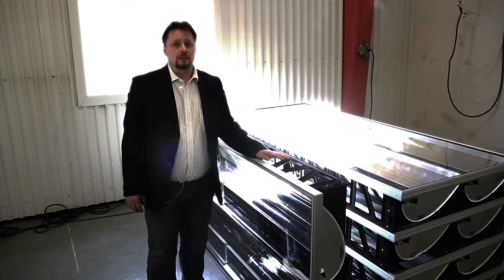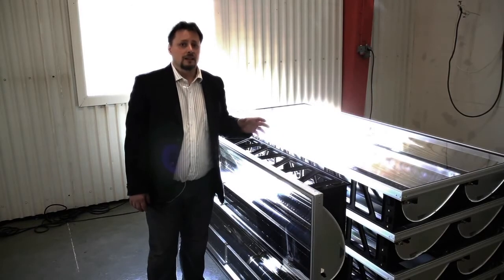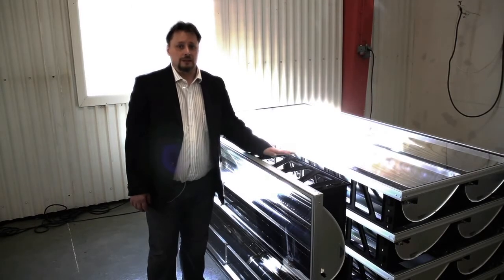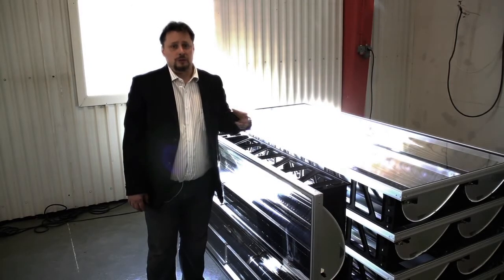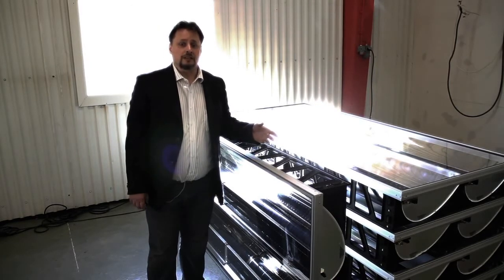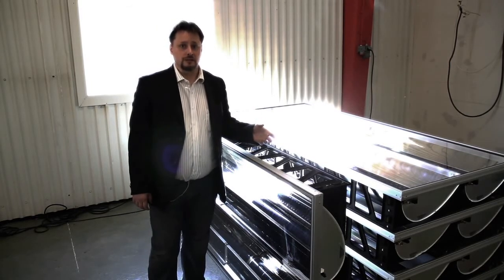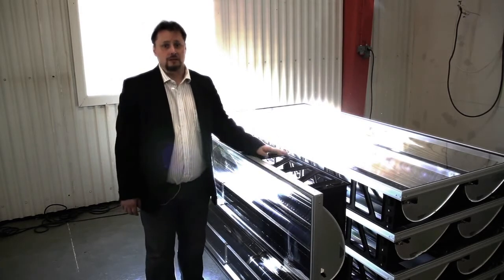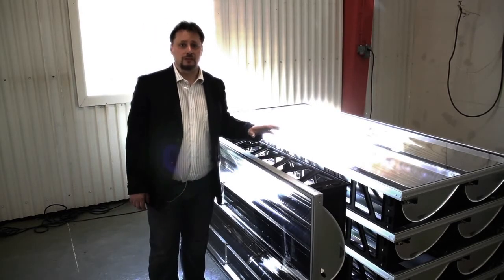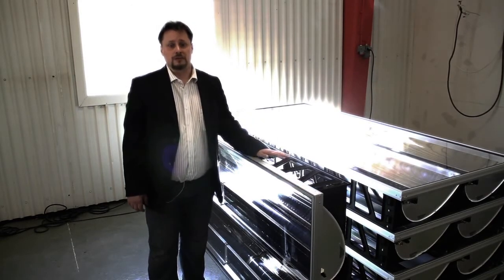The module is designed to operate for both domestic hot water and solar cooling. It is possible to produce electricity directly that is fed into the grid, while at the same time producing cooling that decreases electricity use in a building or larger system. By this, we can achieve a total decrease in electric power use by up to 50%.